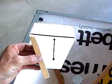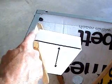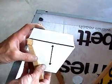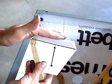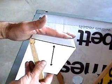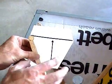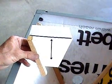For the sides, I've built a little miniature version here to show you what I've done. This angle here represents this angle here, so that piece matches up inside of this angle iron. That line going across represents where the bend is. I didn't need to come up with any kind of a hinge system — I just bent it square to the edge and formed it the way it needed to be. I've also drawn a line to indicate the direction that those ribs travel in that corrugated fashion, which gives it quite a bit of strength.